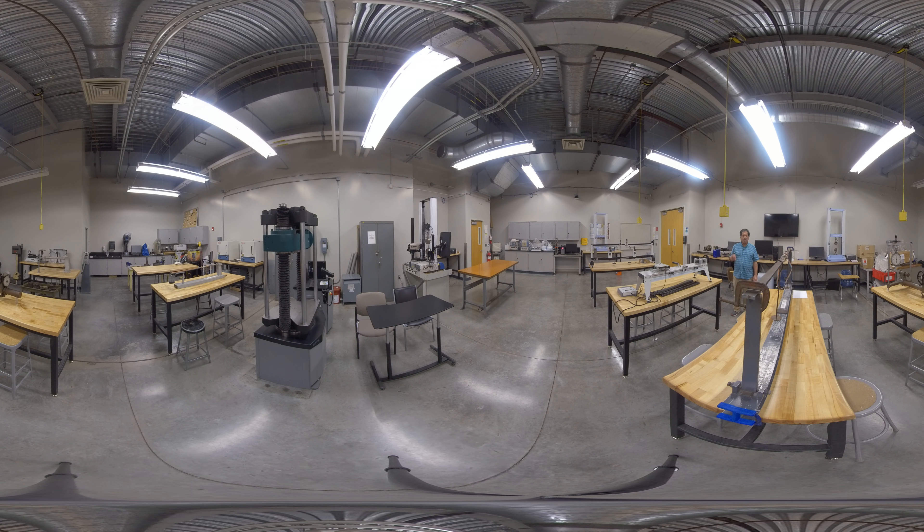In the middle of the room we have a bunch of special-purpose machines designed for just one specific experiment. For example, we do four-point bending over there — we have a four-point bend apparatus set up with strain gauges to measure deformation of the surface of the material very precisely. This piece of equipment over here is for combined loading, so bending at the same time as twisting.